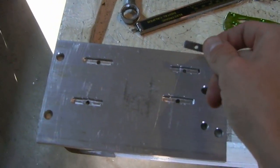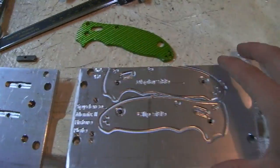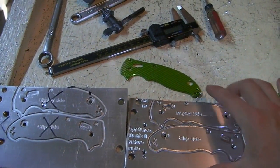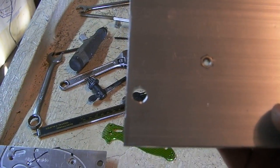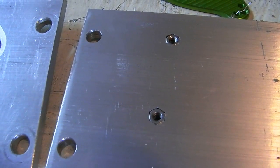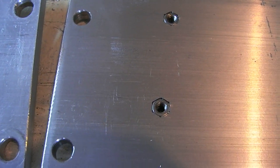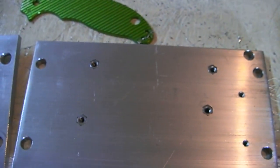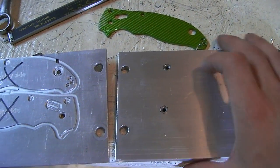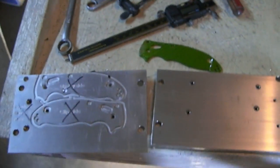These guys started to strip out too. Luckily I made extras so I could pop them in real quick. What you really need is some sort of hardened stainless steel. So here's my new fixture plate — pretty much identical profile. But on the back, I used a tiny little end mill to machine these hexagon slots, and I pressed in some stainless steel M4 nuts. These should last a lot longer, if not indefinitely. And if they ever do fail, I just pop them out from the backside and put new ones in. I bought like a hundred of them, so it should be much better.